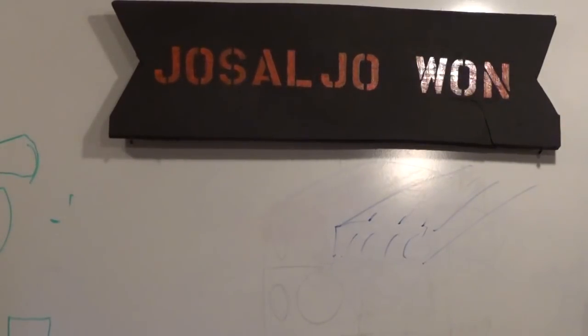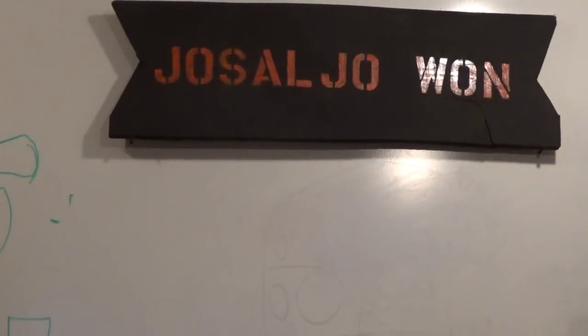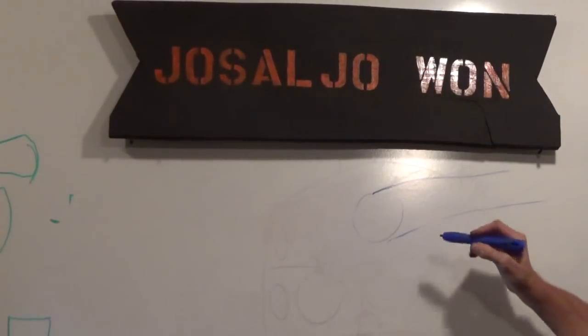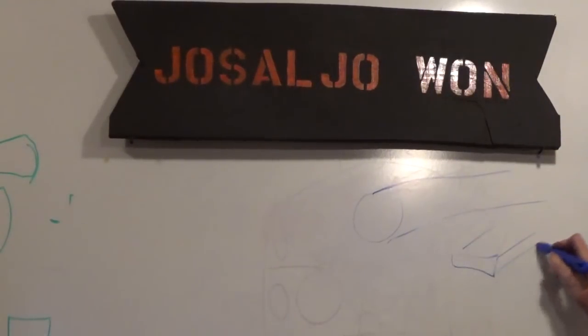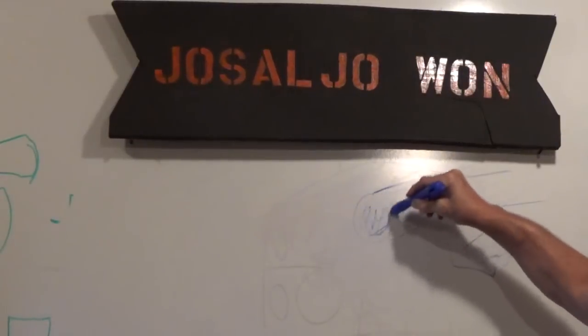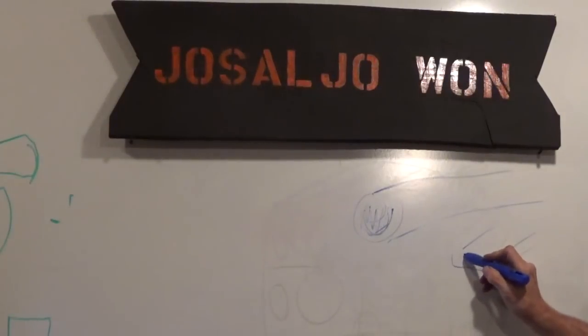And from what I can determine from observation, I'll tell you what I know is true. First of all, I believe that all logs, when they're brought into the mill, should be coated right away. In the log form, not lumber form. And I'll tell you why. After trying to do it with lumber, and trying to do it with the log, it's better if you end coat the entire log, okay? Yes, you lose a little from flitches, but end coat the entire log, both ends. It's better if you do it then than if you do it when you have boards.